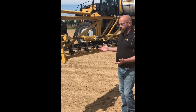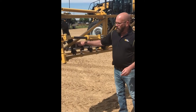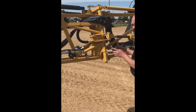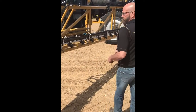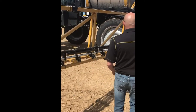The way we do that is all in how we feed the booms. As you can see here, I have one feed line coming into the end section here and then there's another feed line going into this one, even feeding the boom going that way. This one comes into this end, feeding back towards the machine, bringing product in across all these nozzles.